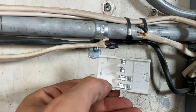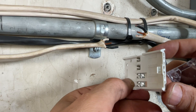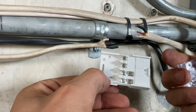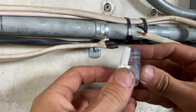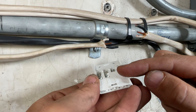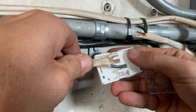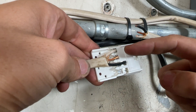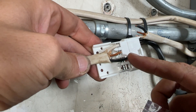The way that this splice works is you're actually just going to press the wires in without stripping them. These little forks are going to cut the insulation and make contact with the copper. Then you'll put the plastic top on — you can see it has cradles in there — put that on top and press it together. That's what's going to press the wires down on those forks and make solid contact. That's also why you want to preset your wires to make it easier to line everything up, making sure your Romex goes through the middle and neutral, ground, and hot all meet up with their respective forks.